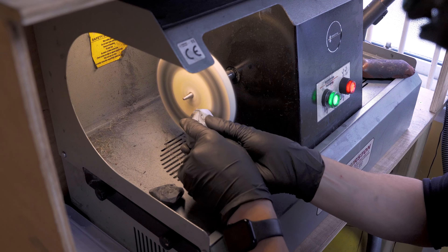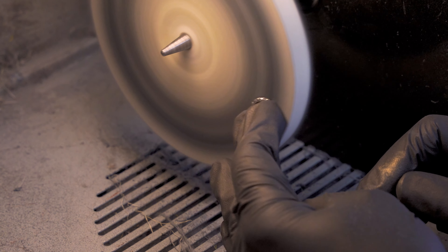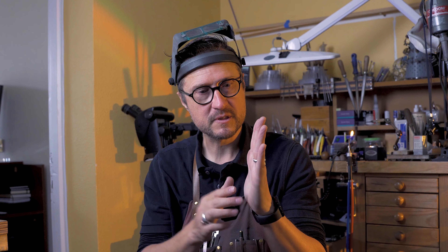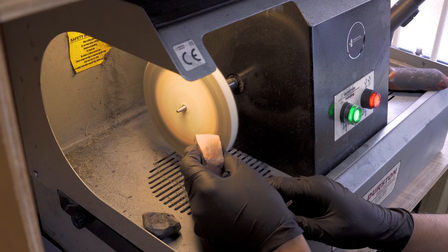The side of the mop — if I'm looking at the mop from the front, the side where the spindle is is where I'm using it, taking advantage of the fact that it's flat and has a lot of resistance. If you're working on a very flat surface on a ring, a big loose fold mop will fold over the ring itself, so your corners will slightly be affected. With a felt mop, if you take the ring and stick it against the side while it's spinning and move it around, that mop's resistance means you get a flat polish just on the flat surface. I use two of them — first stage on one side, then turn it around for second, third, and fourth stages. I mark the mops the same way so I can refine the flat polish and it comes out like a mirror — especially for really flat pendants like a disc pendant.